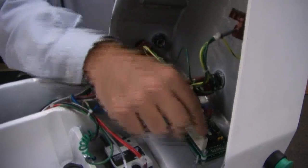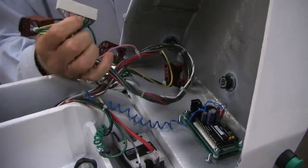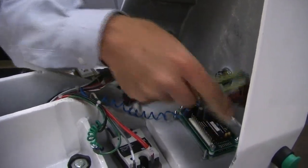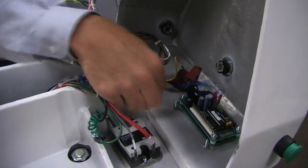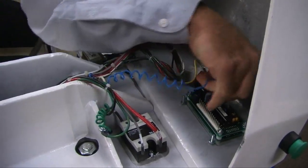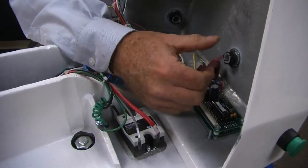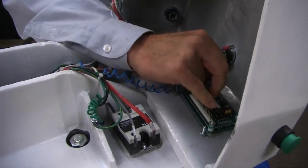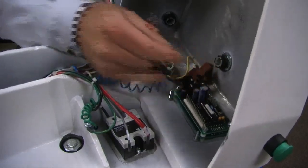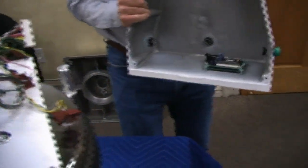We've got to pull the controller off. It goes one way, the metal side up through this way. And then remember I told you about the RTDs being blue. This is the RTD going to the platen. So I'm going to pop that off. Guys, use a needle nose here because if you pull this wire, you may pull the connector off. I have it already loosened for me, I think. Yeah. So now this housing is free to come off. And you can see the control in there.